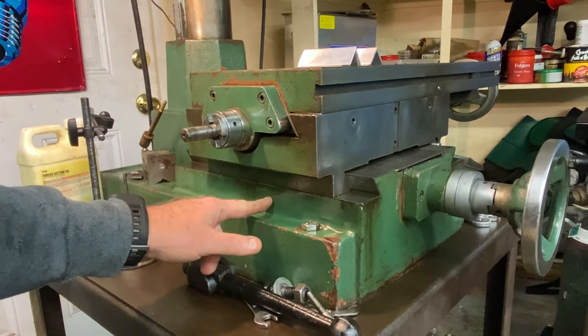We're going to run the y-axis in and out with the dial indicator on the table. We're going to rely on the square for it being perpendicular to the top of the table, but we definitely need it straight when it goes in and out. We can do the bottom and perhaps the top. These two axes — this side and this side — have to be zero, or as close to zero as within tolerance. Otherwise, when the encoder is fixed down here, it'll either want to push together or pull away depending on how this thing is angled. So I didn't do any adjusting yet. Let's see where it's at right now. Running it in — well, that ain't too bad. We're at about plus 20 thou over the run. That means this is 20 thou out, so we want to bump it 10 thou in or take the other one 10 thou out. Let me go ahead and get that adjusted.